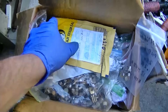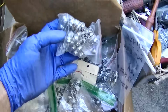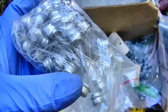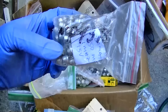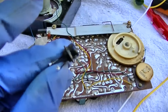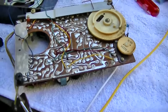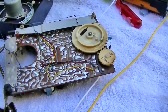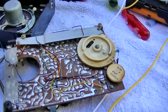I have lots of germanium transistors because I love working on old radios. They always say use a matched pair — well, it's a lo-fi AM radio. These are just straight P-40. I don't know what the difference is. MP-13B — unfortunately I do not have an MP-40. What I'm going to do is try a P-20, and then I might need to order MP-40. I would like to fix this right. It's a stupid pocket radio, but look at how clean and unmolested this thing is — I'd really like to fix this right.